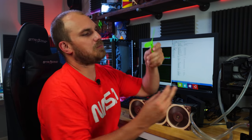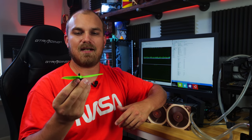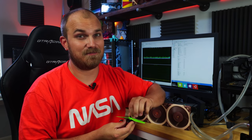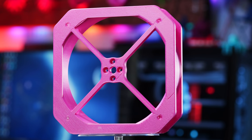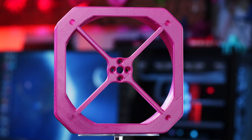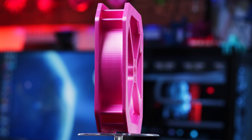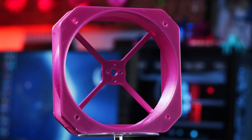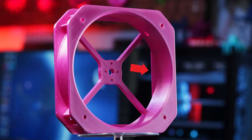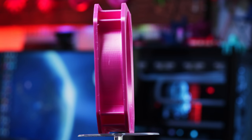The problem with these two items is they were never intended to run inside a PC setup, so finding a fan body to house them wasn't possible — but I was able to make something and 3D print it. This is a custom-made fan shroud for a 5-inch tri-blade mini quad prop. A normal 120mm fan disc diameter is about 110–111 millimeters, whereas this 5-inch prop is 127 millimeters — actually larger than the radiator. So I made the fan shroud with little steps on the inside to keep air from going around the outside of the radiator and force most of it through the fin stack.